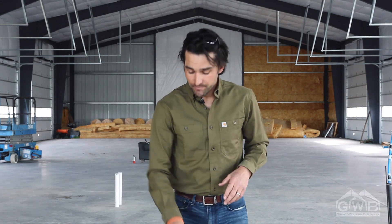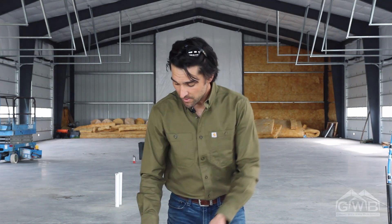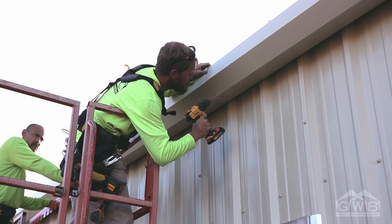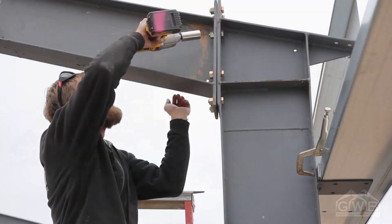As far as drill bits go, I like to have 9/16ths readily available. I really like these step bits, even though they are expensive. I keep a quarter-inch, I keep 3/16ths, and I keep 9/64ths. 9/64ths are good for when you're doing pop rivets on your trim — our pop rivets are supposed to be an eighth of an inch, but because of the paint they're a little bit bigger, and using the 9/64ths allows it to slide in a little bit easier. For half-inch structural bolts, or half-inch A307s — the silver hardware that you use on your secondaries — I like to use an impact with one of these adapters for a half-inch socket on a three-quarter size.